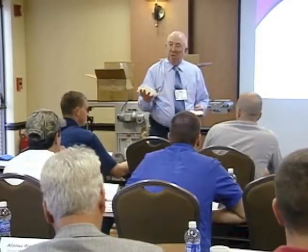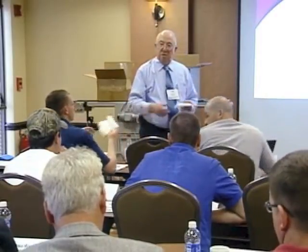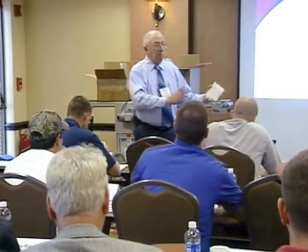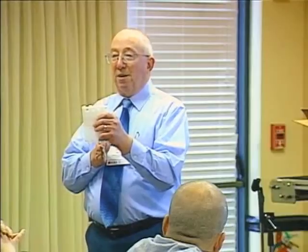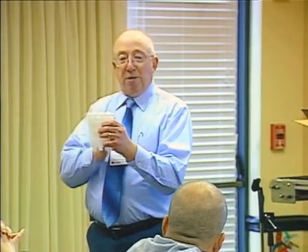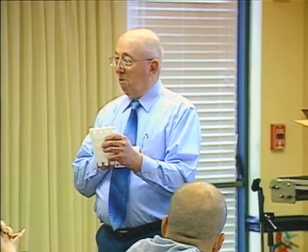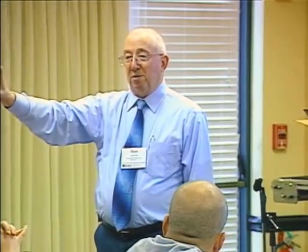The other thing that I wanted to mention when we were talking about widths, talk about the nominal width and the actual width. Nominal width, unlike fabric belt where you can take a big roll and you slit it down, and if somebody says they want a 24-inch belt, you get a 24-inch belt, assuming the guy that's slitting it is paying attention to what he's doing. Now you can cut this if you want to cut it down to get some oddball width, but it's generally done with a bandsaw and it doesn't leave you the best edge out here. So what you're going to go with is whatever the actual width. Most of the manufacturers will tell you what that is.